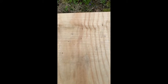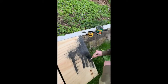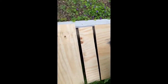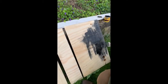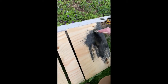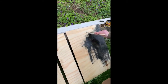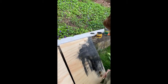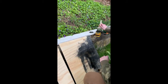Once you have your grooves in place, you'll want to stain the interior of your bat house. That includes the front or top, the vent, and the back of the house. You want to find an exterior grade stain. The home improvement folks suggested we use a dark stain and then coat it with some exterior grade protectant. You also want to have a dark color stain to mimic the inside of a tree and mimic what a bat's natural habitat would be.